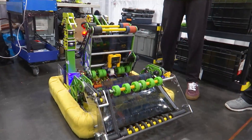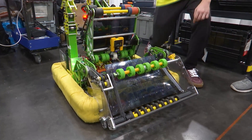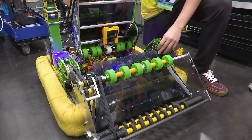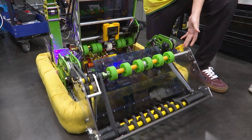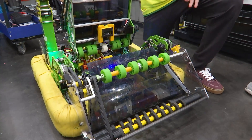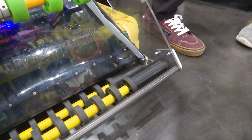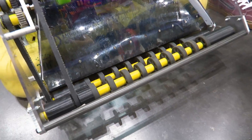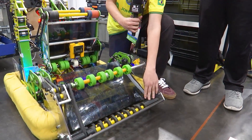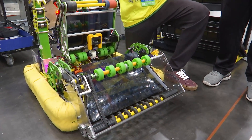So the intake is outside the robot and it can collect notes pretty easily. We have this funnel-shaped ramp made of polycarbonate - it's really resistant to the impacts we're going to have. We focused a lot on making the intake as strong as possible. We added a 5/8-inch aluminum shaft to protect from crashes on the field and collisions with other robots.